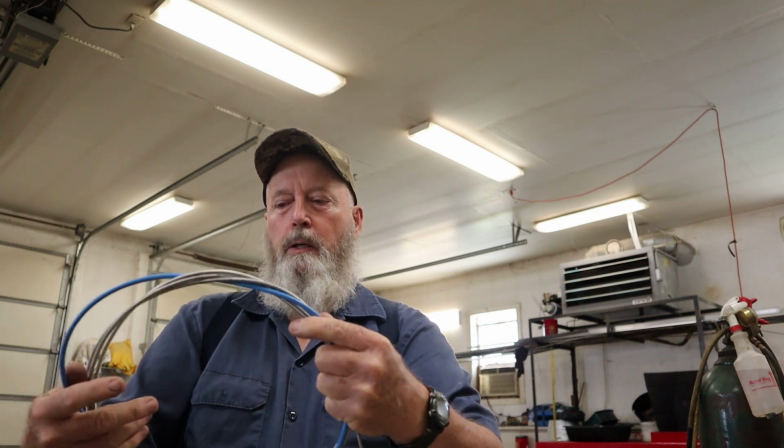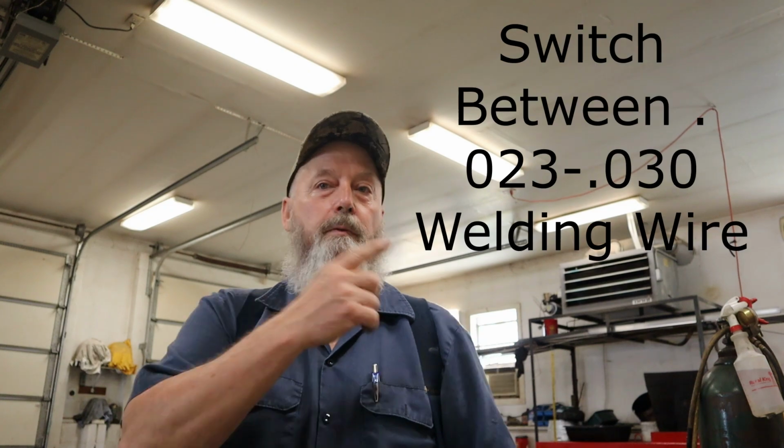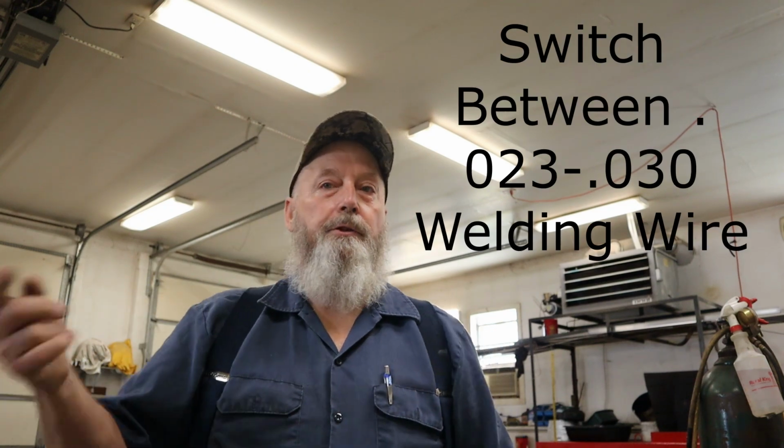I wish that my local Miller welder guys, when I bought the 023 wire, would have said, oh dude, you need a liner too. Would have caused me a lot less grief. But yeah, it is what it is. Now I have an 023 liner in the old gun. I've got a brand new gun that has a brand new 030, 035 liner in it. So we're good to go. If I want to switch from 023 wire to 030, I'll just switch the guns. Takes just a second.